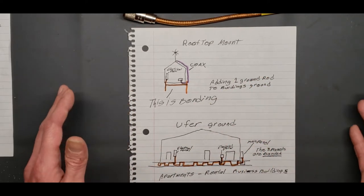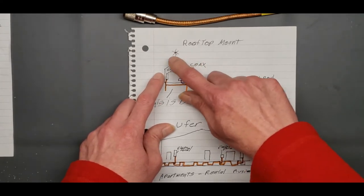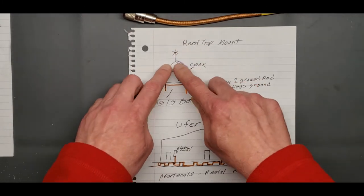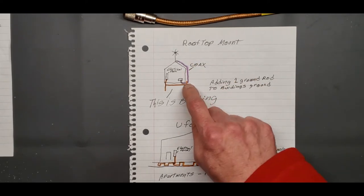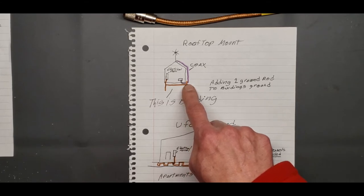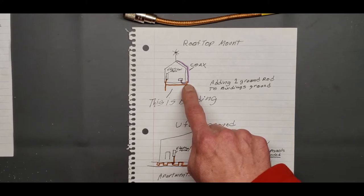That's what those people get paid for, to come in and run wires all the way down and put little needle points up, little antennas up, so that it can pull the lightning around and around. You're not doing that. If you're grounding it, you ground on the ground, okay? Never bring your ground up, all right? And a lot of people do.